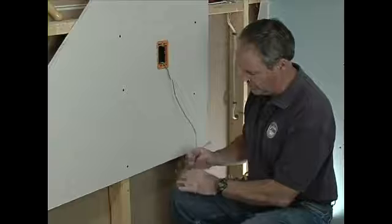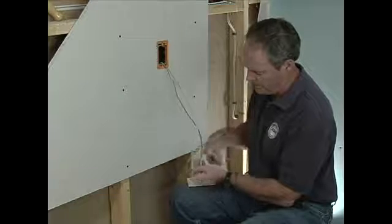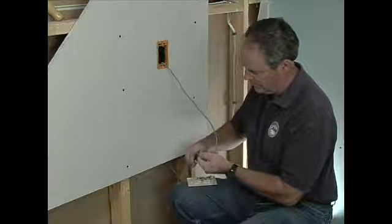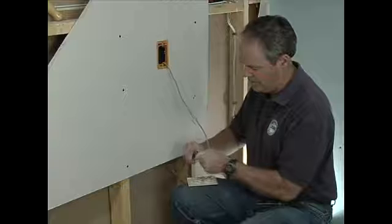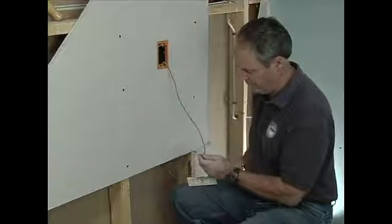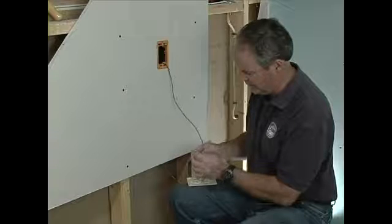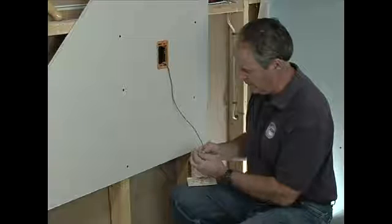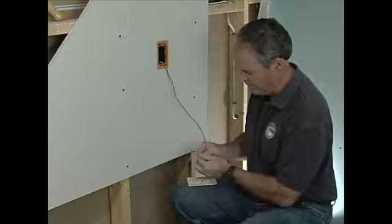And what we want to do, we've got the wire coming through. I'm going to strip it back with these strippers. And be careful, you just cut slightly, and then you can strip off the outer sheathing fairly readily. Okay, so we want to keep the color code the same, so we're going to take the green and the orange out, fold back the other wires so they're out of our way.